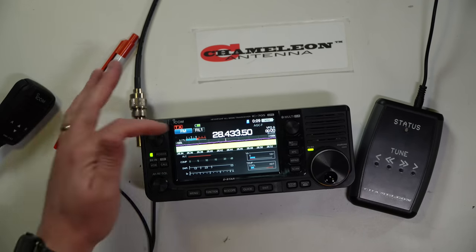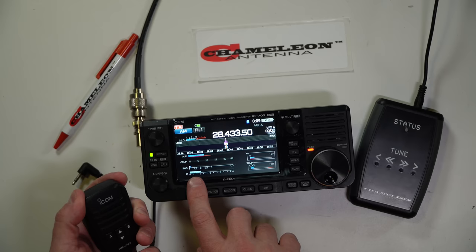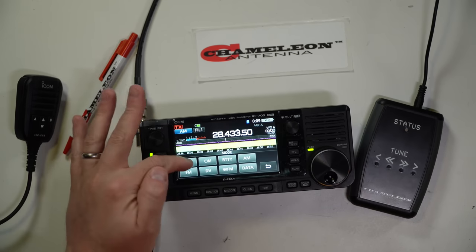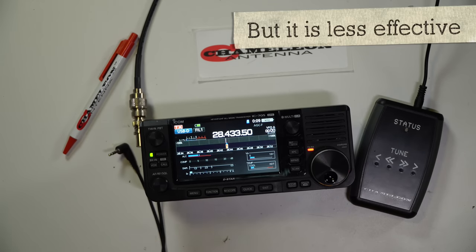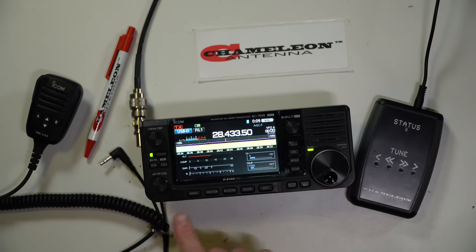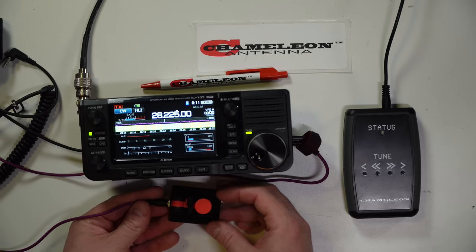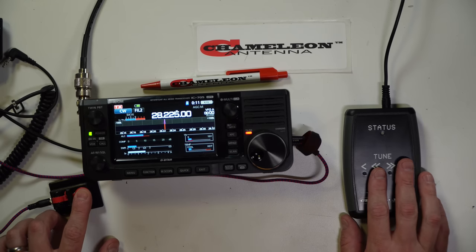You use a mode that has a constant carrier, so you can use FM — I prefer FM. AM is similar but it's not going to give you a true reading; it'll give you a false positive. You actually get to go in here — Kilo India Six November Alpha Zulu — to do the test. You can't use single sideband for this though. As you can see, you get nothing there — just a whistle. You probably don't want to use that. FM is where it's at for tuning this. Of course you can plug in a Morse code key and that'll work even faster — like this little tiny CW Morse key here. I'll just key down in straight key mode and tap the gross movement.